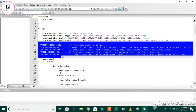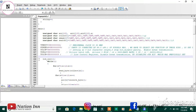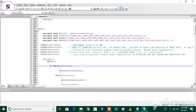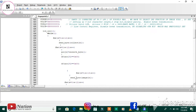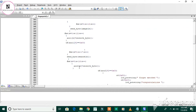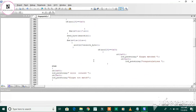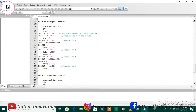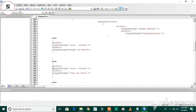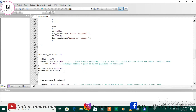These are the settings for the UART. After that, we initialize the LCD using the initialization function. In the while loop, we pass commands one by one: first the collect command, then the image command, then the store command, and finally the search command. When the fingerprint is matched, it shows 'fingerprint is matched'. When not matched, the LCD shows 'error occurred' or 'fingerprint is not matched'.